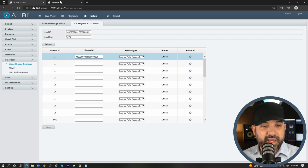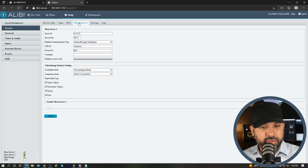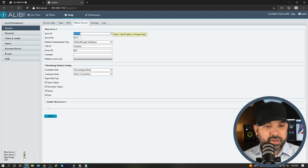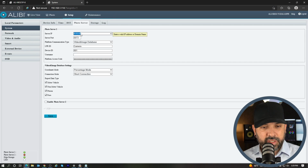So now I'm gonna go over to the camera. And I am gonna go to the system and then photo server here. I already have it selected. The only thing you need to do here is type the IP address of the NVR. So we'll check that out. There's 192.168.1.247. So we'll type that here. And the device ID, we'll just go ahead and paste that in there as well.